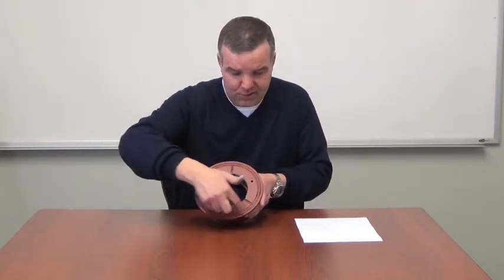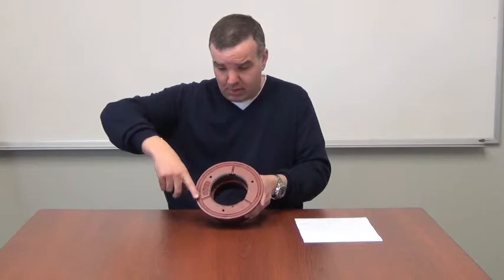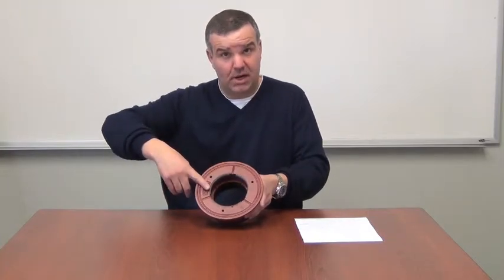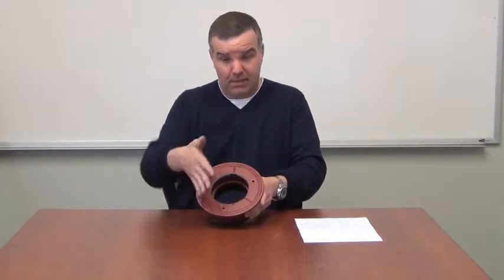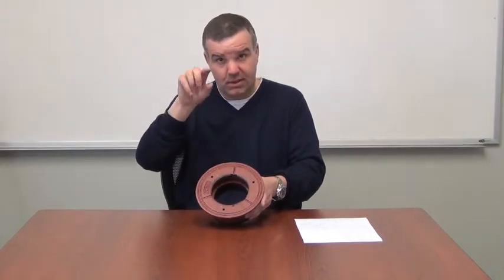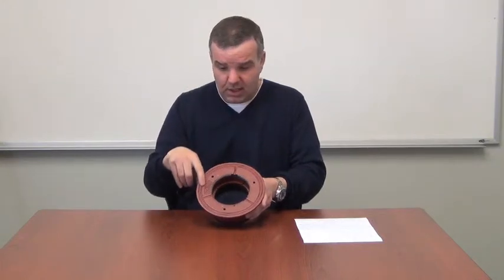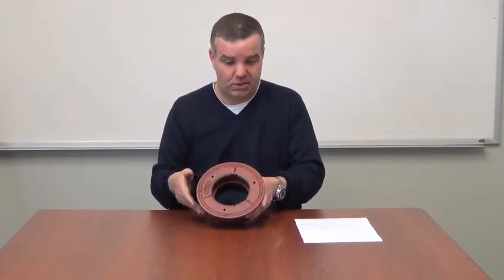You'll also notice we have circular rings around the outside of the flange so that if the clamp ring is required, the membrane goes between the top of the body flange and the underside of the membrane clamp and we can lock in. It's a tongue and groove — there are raised ridges on the underside of the ring that lock into the female recesses in the top flange.